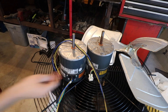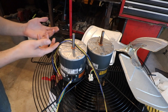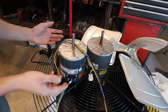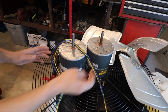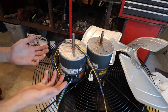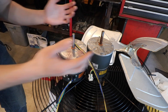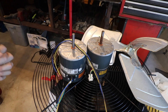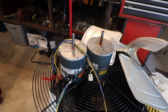Here's the new motor and here's the old motor. Unfortunately this unit has a 10-year warranty, but since I bought the house I've been unable to locate the paperwork from the original owner, so I had to pay out of pocket — about $450 for the motor. These motors have built-in electronic control modules, and within those modules there is their own capacitor. Once that capacitor goes, it's not serviceable — you have to buy the whole motor and electronic control module as one piece. It's unfortunate that you can't just replace the capacitor; you have to replace the whole motor.